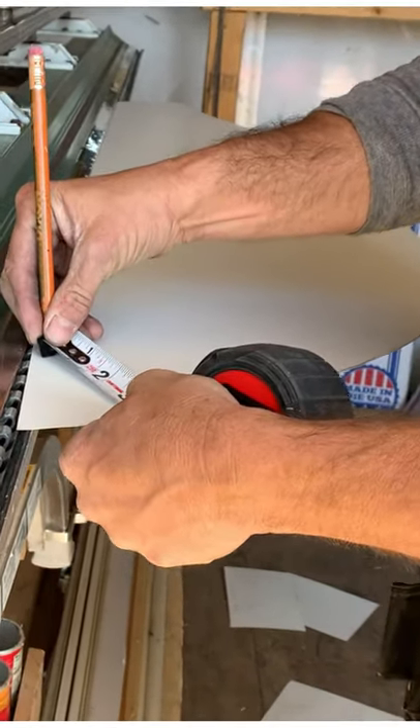You can also put a bead of silicone between the brick and the metal. It's a little harder to do when you have stone — it would have been messier. Just make sure you have a really good thick bead of silicone before you press on that arch. Generally, with a nice clean brick rather than jagged stone like this, we would run a nice bead between the brick and the arch as well.